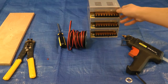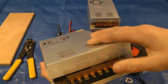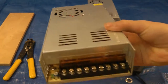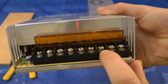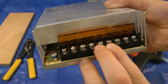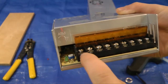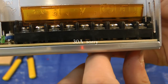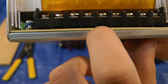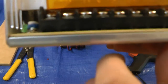So these are 30 amp power supplies and you put the AC 120 voltage in through here and here. This is just a ground wire. And then you have three prongs for minus and three prongs for plus, because just one prong can't handle 10 amps. Under there, there's a wire going to each one and it's so thin that there's no way it can hold 30 amps.